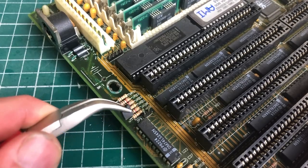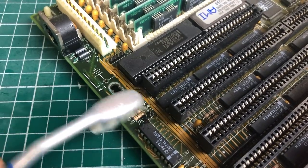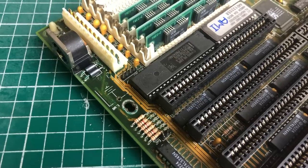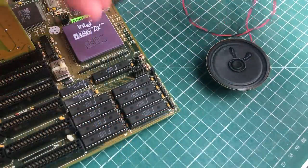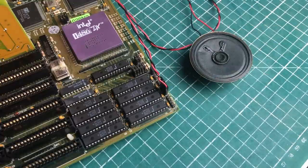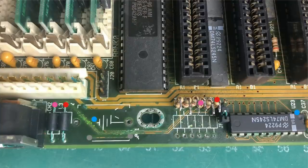The corrosion makes its way onto headers, underneath ICs, and on connectors — it's pretty nasty stuff. When you're cleaning with vinegar, sometimes it will remove parts of the silk screen, so you need to take care of that. As expected, when we turned on the computer with a video card attached we didn't get anything on the screen. You should always attach a PC speaker to the motherboard so you can get audible feedback, because sometimes you won't get anything on screen but the computer can beep error codes. I've pulled up the resistors so I can see the traces that move underneath them, and I've color-coded areas on the PCB where we should have continuity but there isn't — those are the traces we need to focus on.